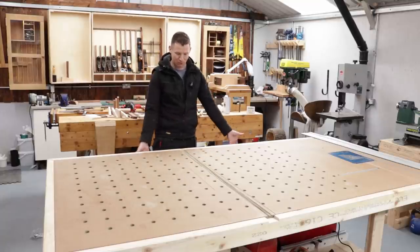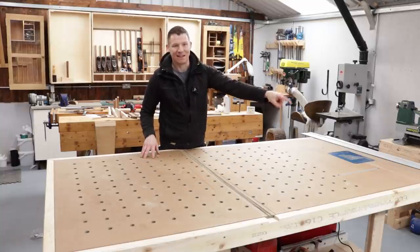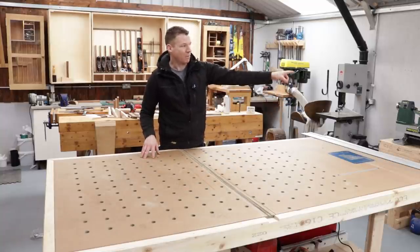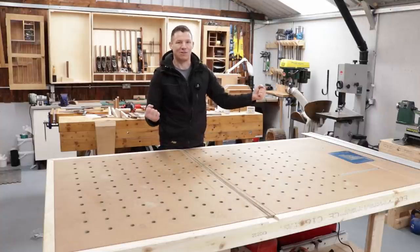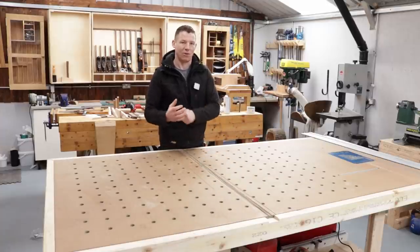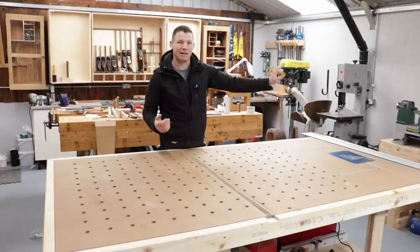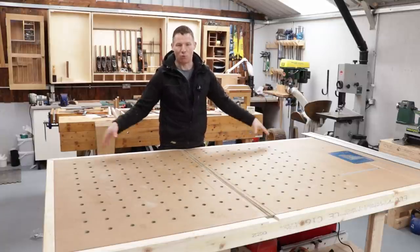So I'm definitely going to have two double sockets on this side, two double sockets on this side. We're going to put an appliance inlet socket down there and another appliance outlet socket on the wall. And I'll just have a lead between the two that I can plug into that socket, and then I'll be able to plug in my bench, and I'll be able to unplug the bench, roll up that coil and leave it to the side, and then wheel this off if I need to move it anymore. So we're going to put wheels on this as well.